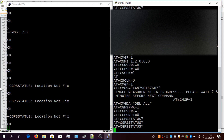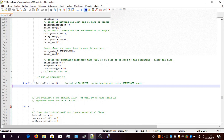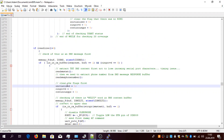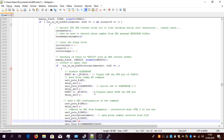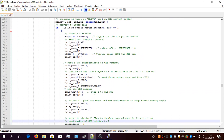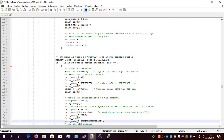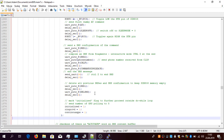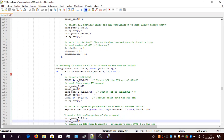When you look into the code, you can see that this part of code is doing exactly this. When there's an incoming SMS, the buffer is checked against predefined program memory hard-coded lines. If the command is 'multi' or 'single' — here we have 'single' — first it switches off the sleep mode. An important thing is that I'm using some kind of variables here to indicate which kind of mode is currently going.